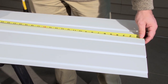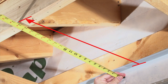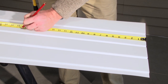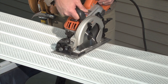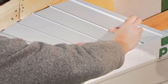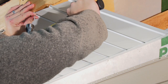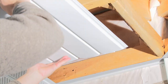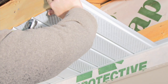The next step is to measure, cut, and install the soffit panels. For each soffit panel, measure the distance from the wall to the front of the fascia board. Mark soffit panels for cutting one-eighth inch shorter to allow for variances in the wall-to-fascia distance. Cut panels with a power saw using a non-ferrous blade. Insert panels into starter and staple or nail to the bottom of the fascia board. Secure panel through the flange or grooves only. Be sure to use one-inch aluminum trim nails if you're not stapling. Insert the tongue of the next panel into the flange of the installed panel and continue for the length of run.